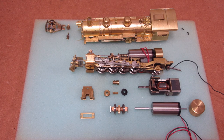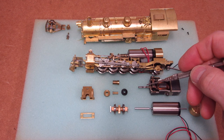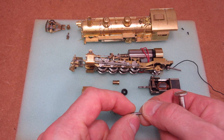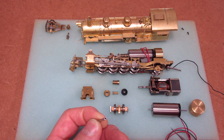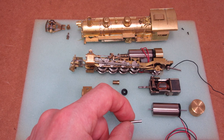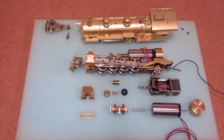A little bit of magic here: this is a 1.5mm shaft, and this is actually a 3/32nds shaft. What you have to do is make these adapter pieces. I use precision ground dowel pins from McMaster-Carr, and then I micro-bore these on my jeweler's lathe to be a light press fit onto these 1.5mm shafts. Then I fix them with a little tiny bit of Loctite. If you ever need to take these apart for some reason, just a little bit of heat is usually enough to release them.